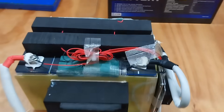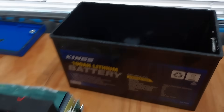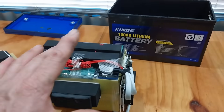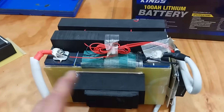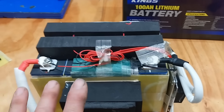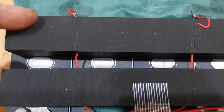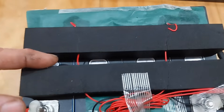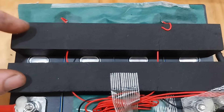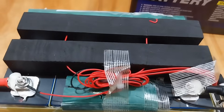I managed to get it out in one piece without doing any damage to the box. You can see they haven't filled it full of silicone, and the quantity of silicone they've used is more than adequate to hold it in the box. I'm quite happy with that — it makes it easier to get out and it's not full of untidy rubbish silicone. You can see they've used two blocks and left the pressure relief valves uncovered — that is another thumbs up.